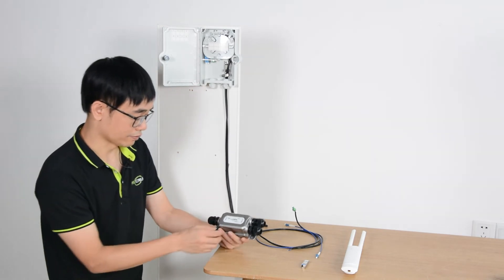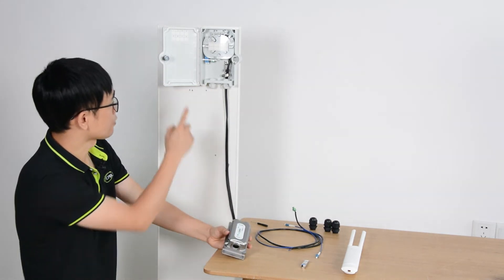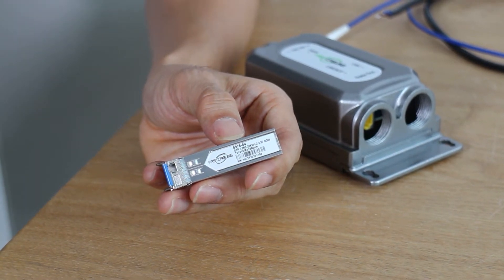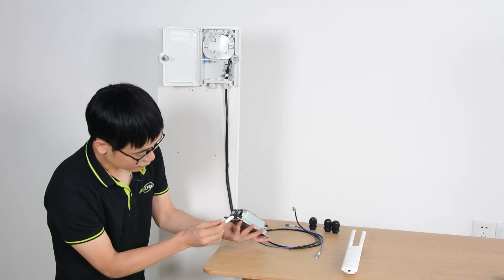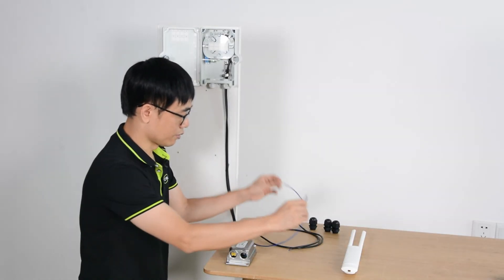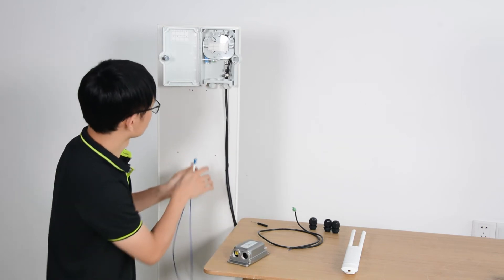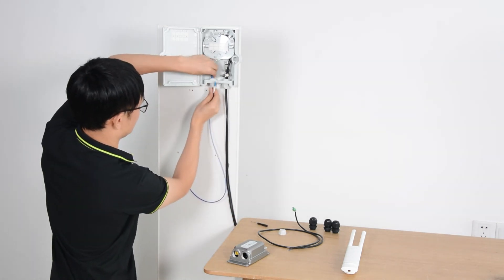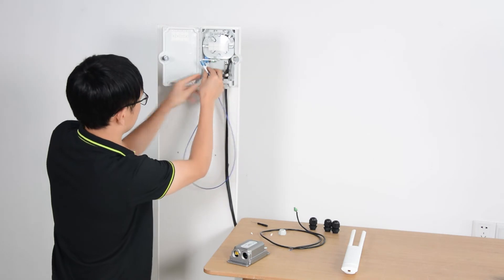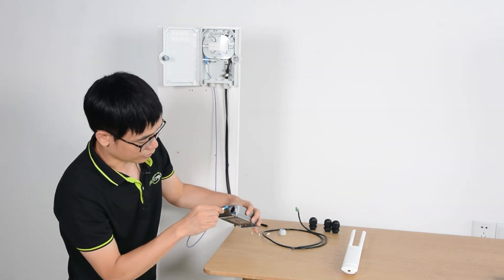Now let me make a quick connection. First, take off all the glands. Before we connect the fiber optic cable to the media converter, we still need to install the SFP module. The SFP module will convert the fiber optic signal to a digital signal. Now insert the fiber optic SFP module into the SFP slot. Next, we'll use a short patch cord to link one of the cables to the media converter. We take the data from the first cable and connect it to the SFP slot.